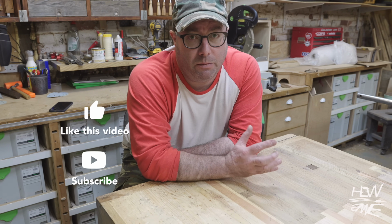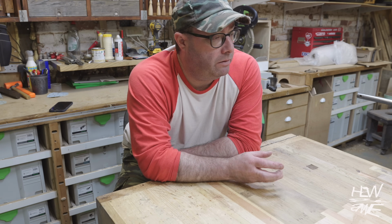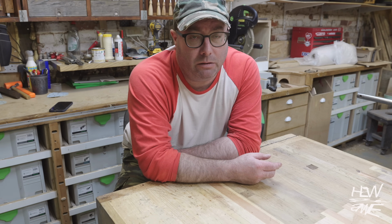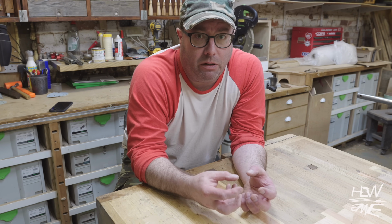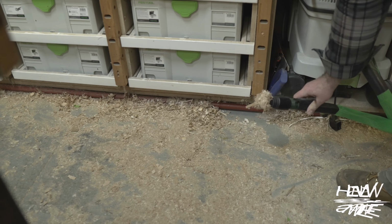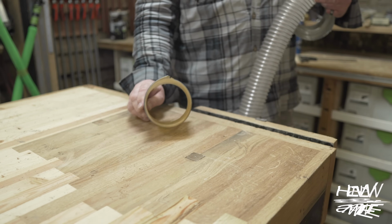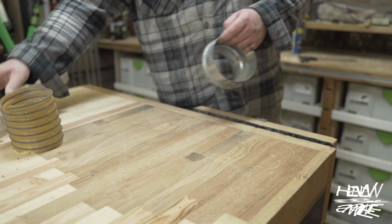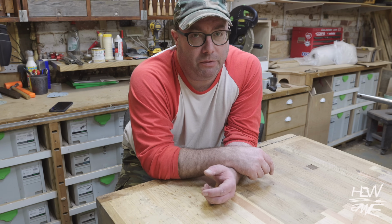And then again, the type of extractors you have on the back of those are for high volume material, for things like a planer thicknesser, arguably a table saw, routers, things that make chips really. Things like a bobbin sander are only going to be creating dust, where you would want more like a shop vac. The simple way of putting it really is low volume, high pressure. If you get the nozzle of your vacuum and hold it close to where the dust is, you'll find it'll only collect the dust quite close to where that nozzle is. With the HVLP, because you've got a great big hose like that, you'll find it'll collect chips and dust from a larger area. I can't imagine what sort of horsepower motor you would need on dust collection to run around a whole workshop. Probably 5 horsepower or more.